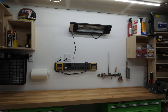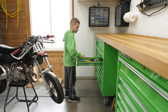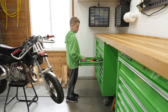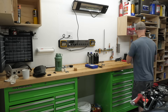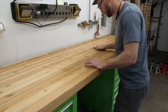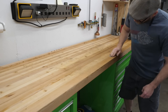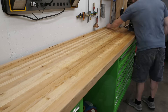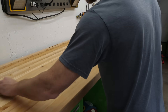I've been using the bench for a couple of months now. It's received a good beating, so I thought I'd make it look a little nicer for the finished shots in the video. I gave it a quick sanding and threw another coat of oil on. This time I used butcher's block oil because it's what I had laying around — smear some on, let it sit for a while, and then buff off the excess.